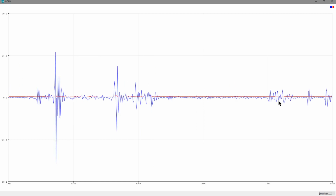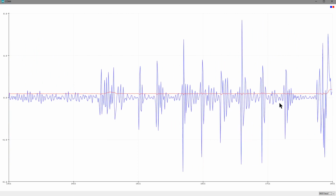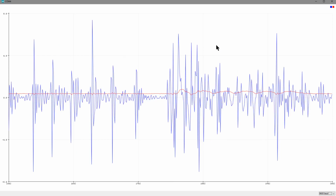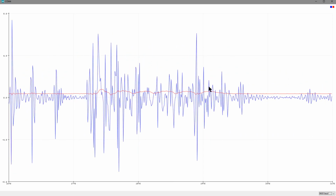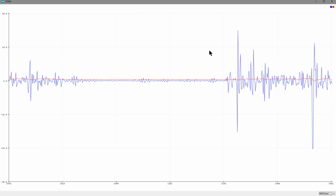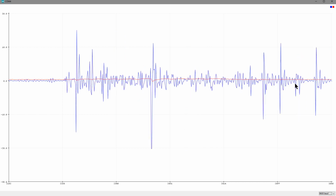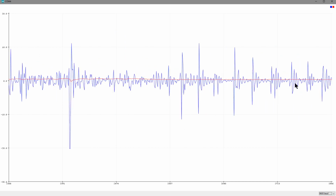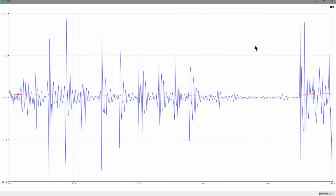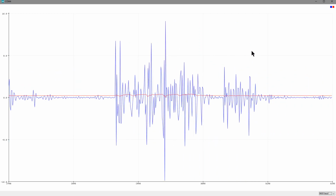I can hit it like this and it does not change the motor speed that much. But if I tip the robot back and forth, then it's also taking the input from the gyro along with the rate of change and changing it. This is tipping forward, backward. You see the red line moving, and this is banging on the table, making the accelerometer bump, but the red line is not changing for the motors. This is tipping, that's banging. You see the difference? Big difference.